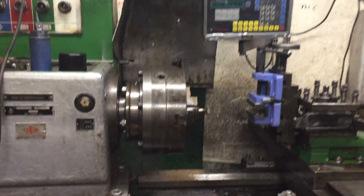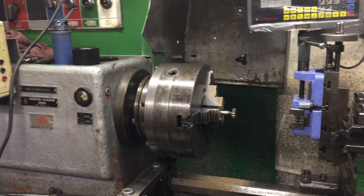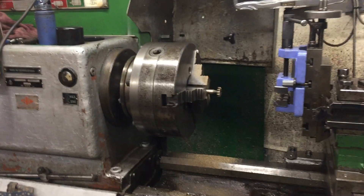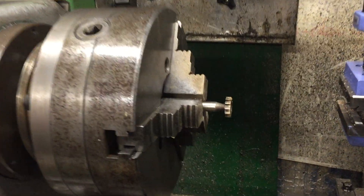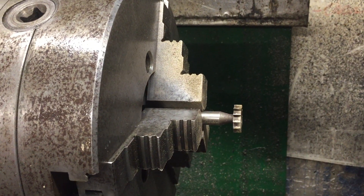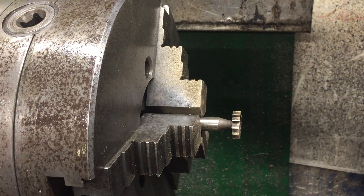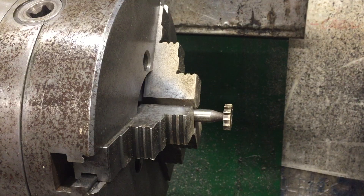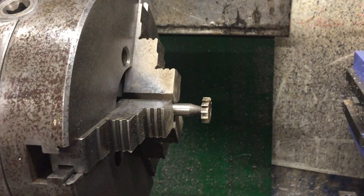At the moment I've got the 250mm three-jaw chuck on it — one that I bought second hand. It's quite rusted but in very good condition. I've got a Woodruff-style cutter in there for cutting T-slots. I've also been running a 12mm and a 6mm in there, and that stays pretty central, gives a good grip and good drive.